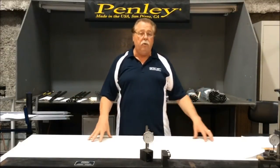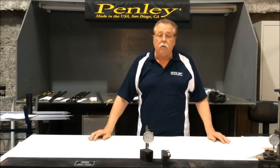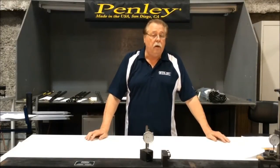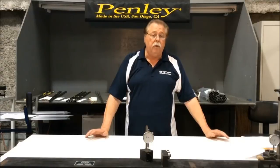Breakage is another problem you have with counterfeits. If they don't get the tip rolled right, or started right, you get voids, interlaminar voids, and you get interlaminar shear. And it tends to crack and damage the fibers inside. Sometimes you can't even see it until that head flies off. So very critical, be very careful.